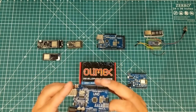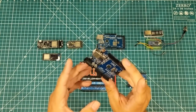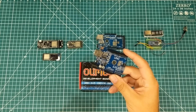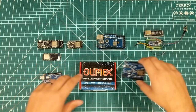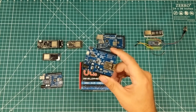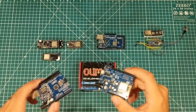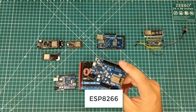Most of you are familiar with the Arduino Uno — this happens to be a clone. Your basic 16 megahertz board with some GPIO pins, 14 or so pins that you can use. This is the everyday maker board, and some of you may be familiar with the one that started taking the world by storm called the ESP8266. This one runs way faster — this is 16 megahertz, this is 80.